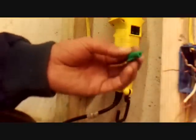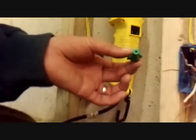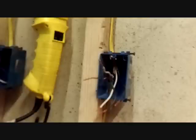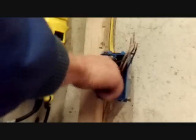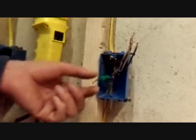Now I'm going to show you one more thing — I'll cover this in more detail in a later video, but this is a special wire nut. It's green because it's for ground, and if you look closely, there's a little hole right there for the wire to come through. Over here I've just simply twisted these wires and cut the excess off. Some places, especially new construction, require that you use one of these green wire nuts. I'll go ahead and put this on — get one of the wires out of the way and twist it on. Simple as that. You've got your wire nut securing the two wires together, and then you've got your pigtails sticking out. We're going to do that with the hot and neutral wires too and go ahead and pigtail them.